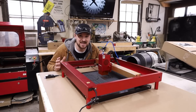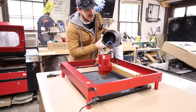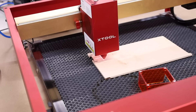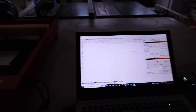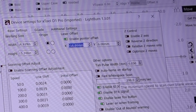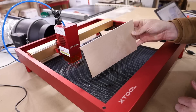One more thing I need to set up is fume extraction. xTool does sell an enclosure with a fume extractor, but I'm just using a fume extractor from my shop, pulling smoke out through a window. I also need to change the laser light offset — I fire the laser and measure the distance: 21 millimeters. In LightBurn, go to device settings, enable pointer offset, change the X from negative 16 to negative 21.